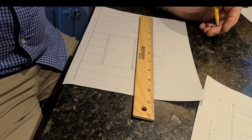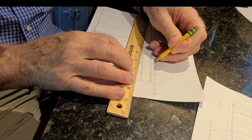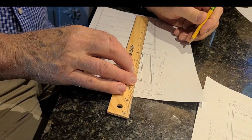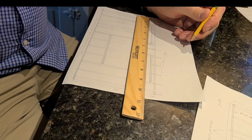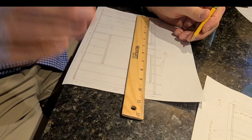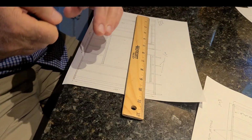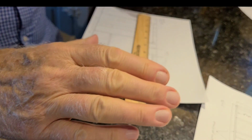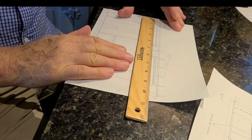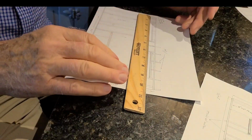Roofing nails, but then the roofing nails punch through the plywood, and on the inside you've got nails sticking out. You don't want that. So we're going to use a staple, and the staples hold those down. The roofers use them all the time. You see roofers up there, they don't swing hammers anymore. They get up there and pop, pop, pop, pop. They get guys going along laying shingles, and the other guy coming behind and adjusting it, bam, bam, bam, and then they can lay a roof up quick.